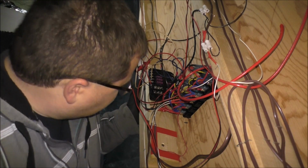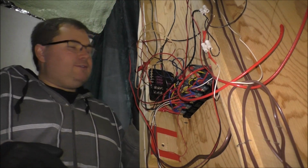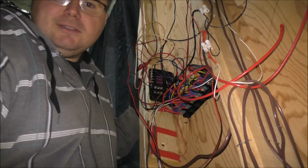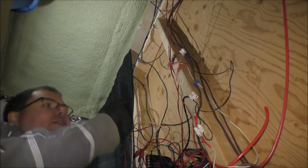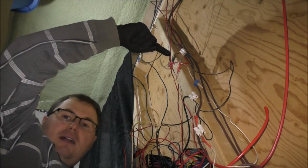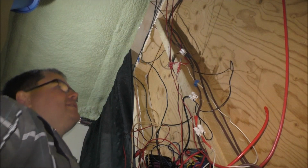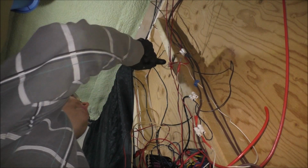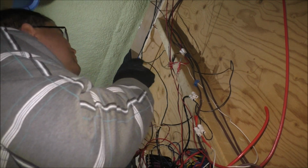And I believe all the fuses are in tight and ready to go. So everything looks good. So I have mostly 3 amp fuses installed. But I do have one 2 amp fuse installed. And then up here, I'll tilt the camera up. At the beginning of my little video series on this awful looking wiring, before I had the fuse holder purchased, I made my own little inline fuses here. So I just took blades and stuck the blade fuses into the female blades. So they work, nothing's blown. These are 2 amps as well. And I believe these are on individual loads, which is nice.